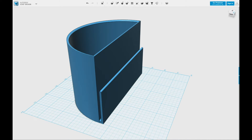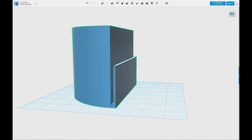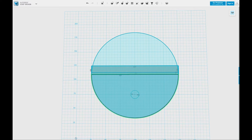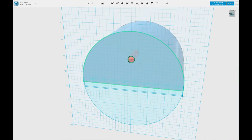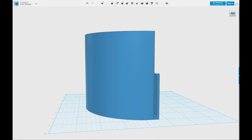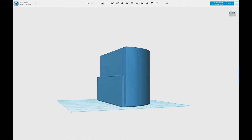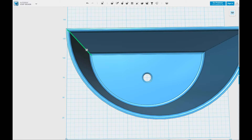As you'll see when I'm printing it, this is going to be a little bit of a problem, but not a problem you can't repair. I'm looking at it from all sides now, and I'm deciding there has to be a hole in the middle — because when water falls in, there has to be a possibility for the water to escape. So I'm making a small hole, and that hole will also be rounded. I'm also rounding the sides of the object, not to make it stronger, but so my spatula can fit between the build plate and the object so I can easily remove it.